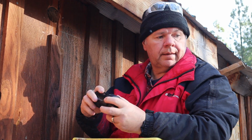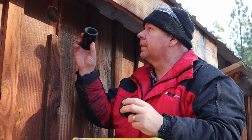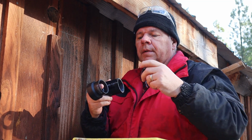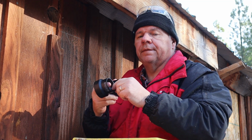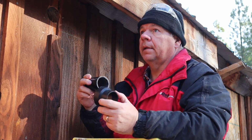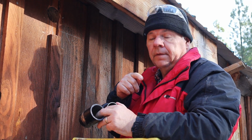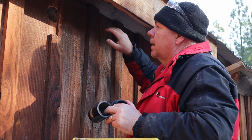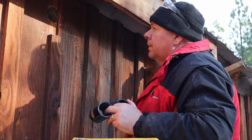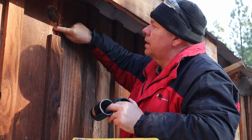I'll glue it. I probably have to dry it off because it's wet now, because it's cold this morning. And then get that started so that I can cut a small chunk of 1.5 inches. Probably glue that 90 on there and then stuff that 90 in here, and then I'll show you how much it protrudes out. And then on another video, probably the next video, I'll notch that 4x6 header to come up here. Now this is the level line with the bottom of this header, so this much needs to be notched out, and this is the center line.